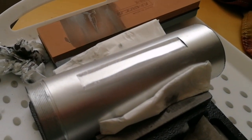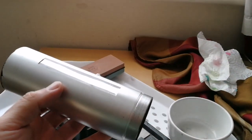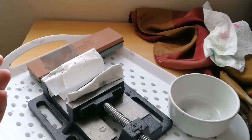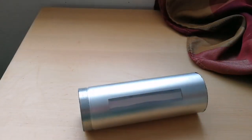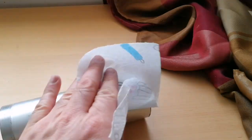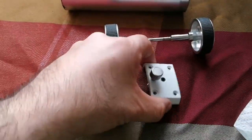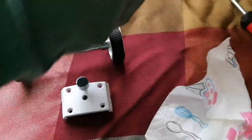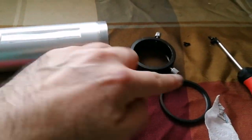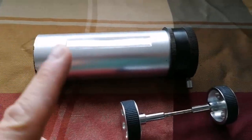The center did get a little bit more abrasion from both sides, so some material was removed there, but I feel it's a surface I'll be happy with. I'll try it and see if it can hold the eyepiece and move smoothly. Now I've removed the focuser from the vise and I'm going to assemble the focuser system again. I'll make sure it's clean using a kitchen towel or rag, slightly wet, to wipe it down.